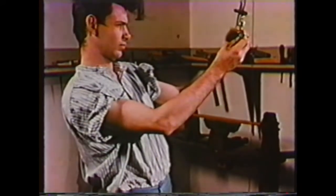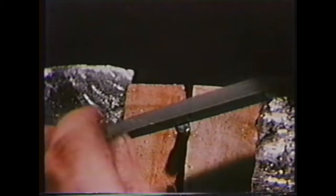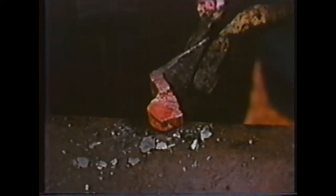Once the lock plate and cock are finished, the remainder of the inside parts of the lock can be made in proportion to them. The steel is made of an old file welded to a bar of wrought iron. Welding wrought iron and steel is hard to do because they have different fusing temperatures. The file is the hard striking area for the flint; the wrought iron gives it toughness. If it were made entirely of steel, it would be too brittle and very likely break. Sometimes they are made completely of wrought iron and case hardened, or a piece of steel is riveted or brazed on the iron.